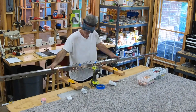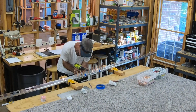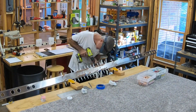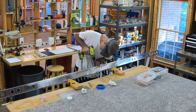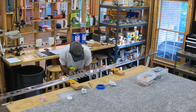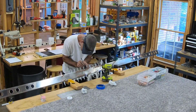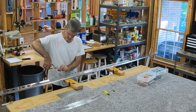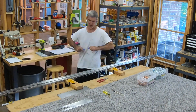If anyone's ever wondered what this pink goop is that I occasionally put on my drill bits or countersink cutters — it's called Boelube. It's a very soft paraffin lubricant developed by Boeing, so it must be good. It should make the cutters and drill bits cut a little easier and last a little longer. It definitely seems to make them cut easier. I don't always use it, but if I'm going through thicker material or using countersink cutters, I'll try to use it.